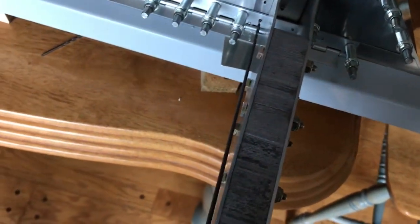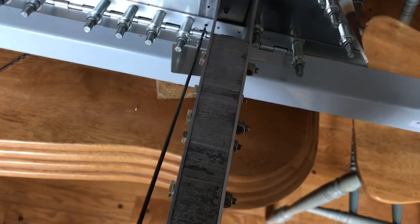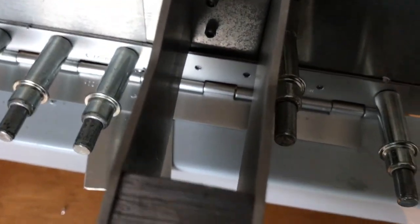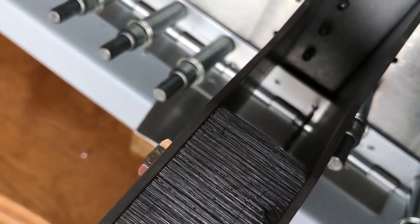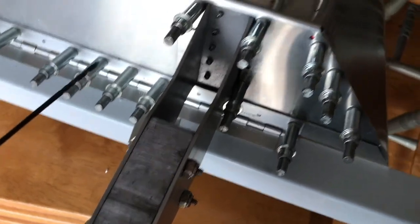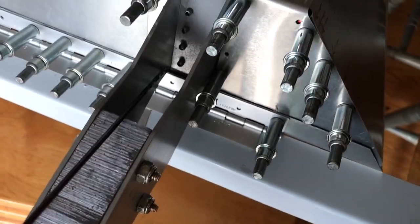I can line it up in the hole, and if in a really tight spot these are flexible enough where you can actually bend it and go straight in — have the cutting end go straight in while holding the drill at an angle. I'll drill these two on this side and that side. There are two more down in there I can't get to even with a 90-degree angle, so I'm going to remove enough clecos to get the counterweight assembly out and then cleco it all back together without it in place and drill through those final two holes.